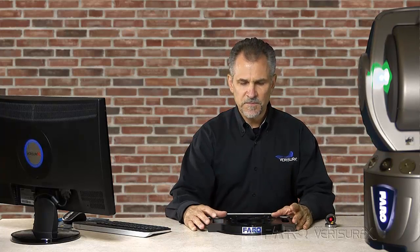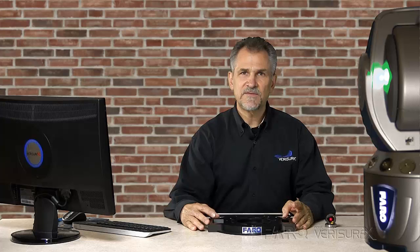When we use build mode to position a part, we assume the form of the part is good and the deviations are due to errors in position of the part. We refer to this use of real-time deviation analysis as build mode because we often use it to build fixtures and assemblies, but we can use it anytime we want to position an object in 3D space.